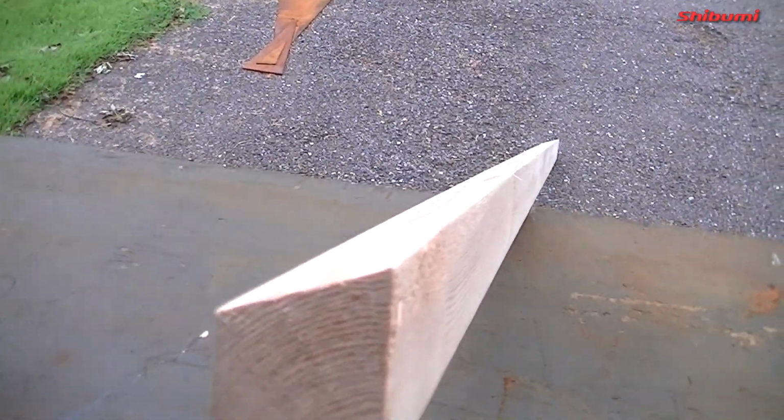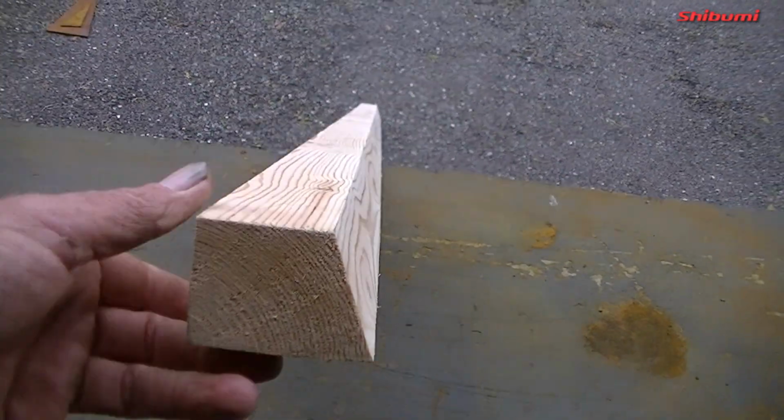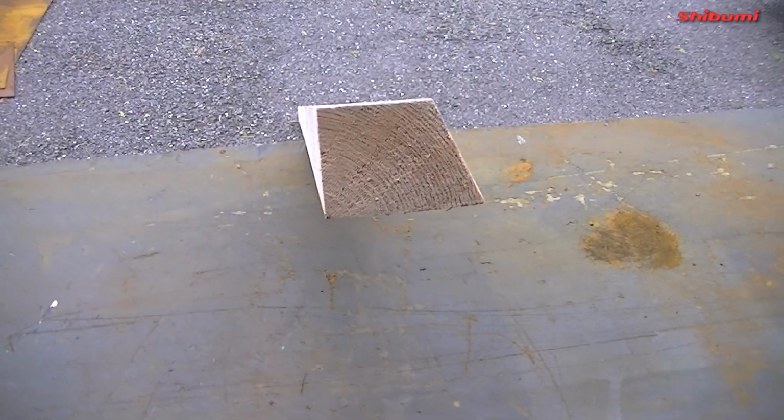So the metal to make the frames to hold down the 2 fuel tanks has arrived. As 40mm box, and some of the flats for the angle iron I'm going to have to make at 113 degrees. So in order to get that angle made from 2 flat pieces, I don't have a circular saw. Well, I have one, but it's not set up right.